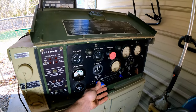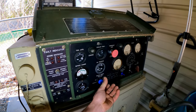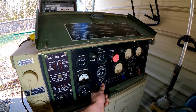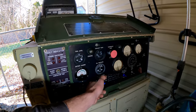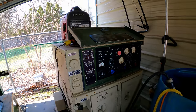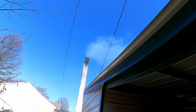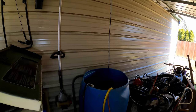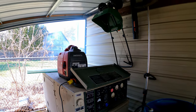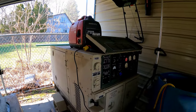To fire this up, go preheat. It's about 20 degrees out right now. We'll preheat this, then go master, then fuel, let that prime. Hold that until you get oil pressure, then you can let off. If you don't wait until you get oil pressure, it will shut down. See how much it's already smoking right now? When you run this thing, you can smell it all the way out front in the street. It usually doesn't smoke that much — that's just because it's cold out. But here's just what it sounds like.